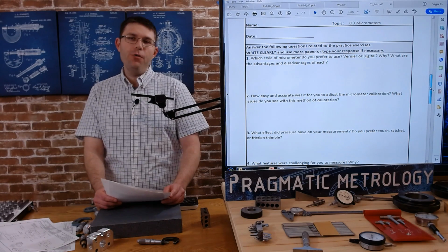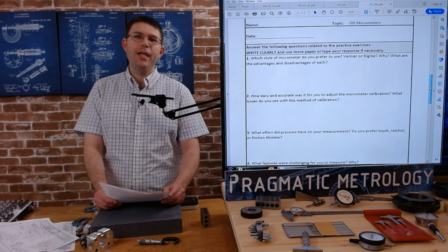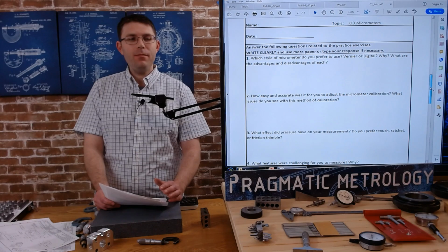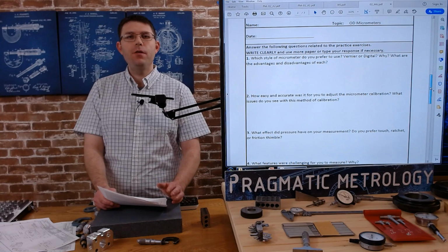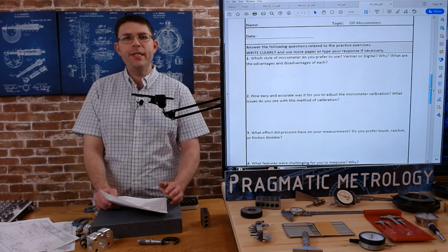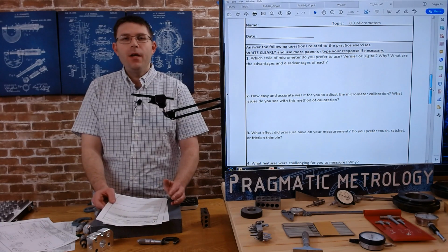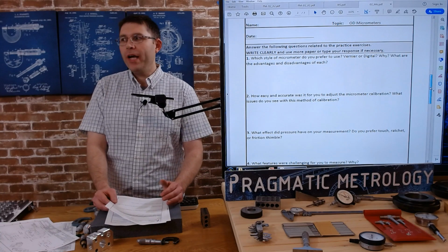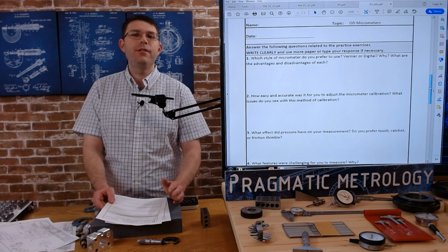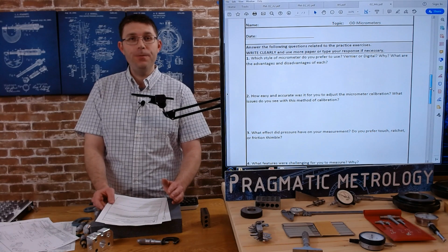So maybe a good reason to answer why you like a digital is that it is faster. I will give you that. It's faster if you don't have to do the Vernier math, and if you're inspecting with it all day, then definitely it speeds things up. I wouldn't say it's necessarily more accurate. Some people would say that it is because it's digital, and that's also not a good enough reason to say it's more accurate just because it's digital.